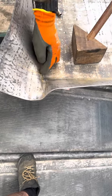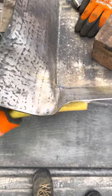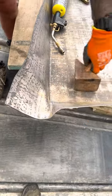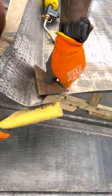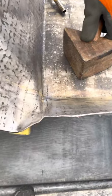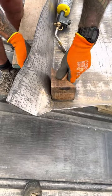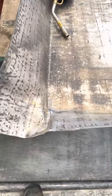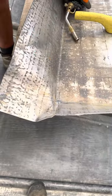You can see it's already started to form that roll shape there, where that roll's going to be. What you're going to do is keep bringing this up, so it brings that up at that angle. So you put that there. Tidy that up. Just tapping up. And what we'll do is we'll just fold that over a little bit. A bit more heat on this top edge.